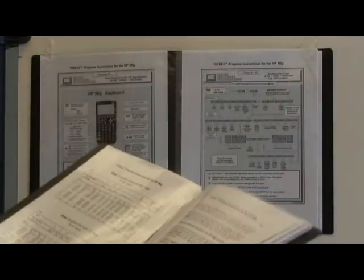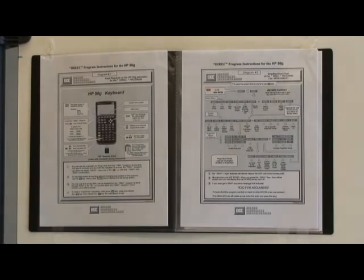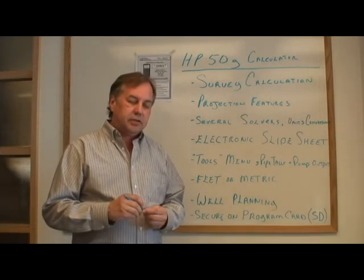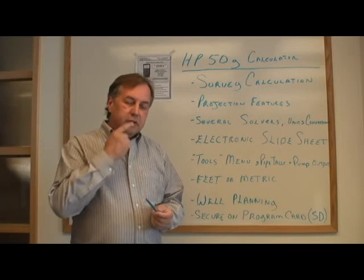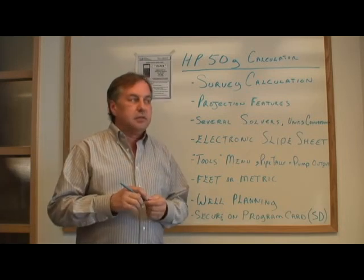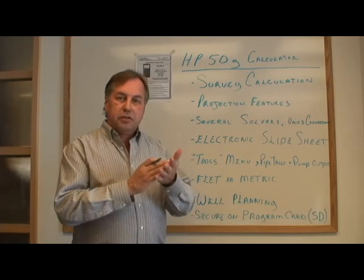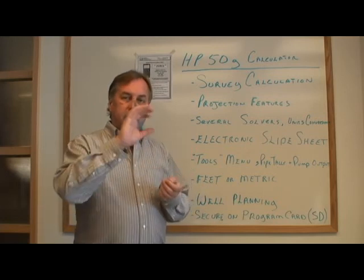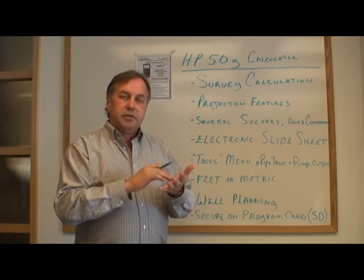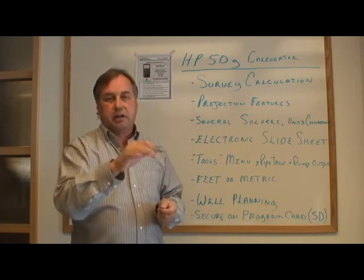The third page consists of 2 surveys. There's a build and hold well and a horizontal well. These surveys are used for the survey calculation samples to be used later throughout the manual. As you get used to using the program, and say you're calculating surveys, you're going to find quite a few things in there that work in a special way. Like after say you want to add a survey, when you press the Add Survey button, you can either put in your bit depth or measured depth, and by pressing the proper button, it'll figure everything else out for you for your depths, because you've already got a sensor to bit distance in there. If you want to put in just a single length, it doesn't matter which button you press. You'll find it's very easy to use, and it's very foolproof for figuring out your depths for adding a survey.